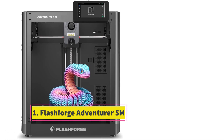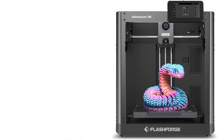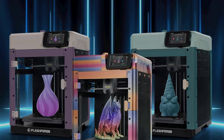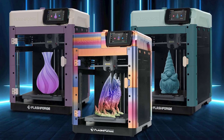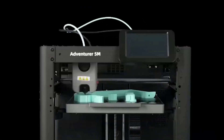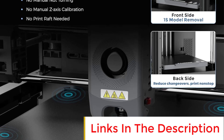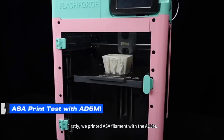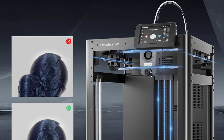Number 1: FlashForge Adventurer 5M. The FlashForge Adventurer 5M is the cheaper of FlashForge's two 5M CoreXY 3D printers. It's somewhat bare-bones in that kinematic realm, being an open-frame machine with no auxiliary cooling fan, but sells for just under $300 and delivers excellent prints. The Adventurer 5M comes with auto-bed leveling and Z-offset via a sensor array in its print bed, features networking capabilities over Wi-Fi or Ethernet, and is ready for vibration compensation and input shaping, meaning you'll have all the auto-calibration you'd expect from a modern CoreXY and can fire prints off over your network.